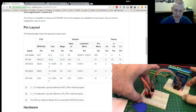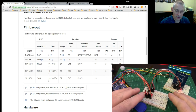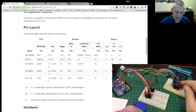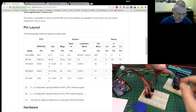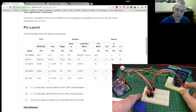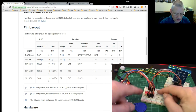One thing you've probably noticed straight away is there's going to be an awful lot of cables. This is SPI based, not I2C, so you need four or five cables for that alone, plus power and reset. As you can see, that's seven cables. Seven cables from there to your Uno would be okay, but I've got this thing in the middle.